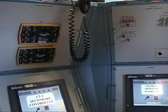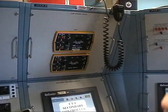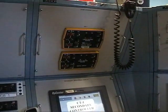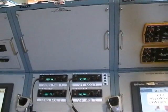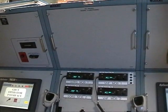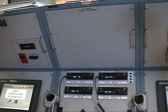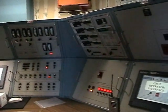Today we still use the same method coming in over the refurb site. We stretch a piano wire across the tops of the mounts — the mounts are supposedly level and straight up and down. As we come across those mounts, we've got magnets we put on the pins of the MLP, and they watch it as it goes down that wire. They'll tell the cabs to give them an eighth degree right or north, south, east, or west depending on where we're at. When he gets back on line, they'll straighten it back out, follow that wire, and we come in to under a half an inch square. We have a plus or minus one inch on laser, and plus or minus two inches on the eye.